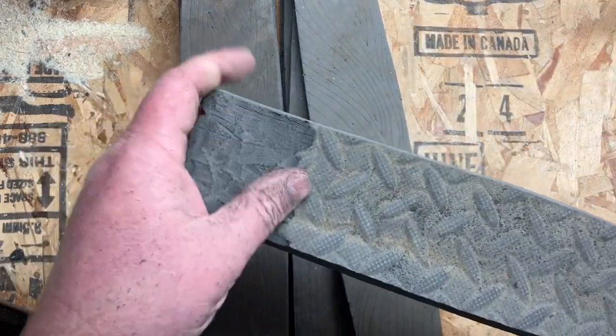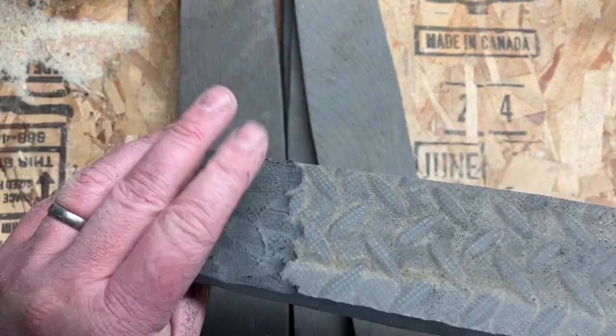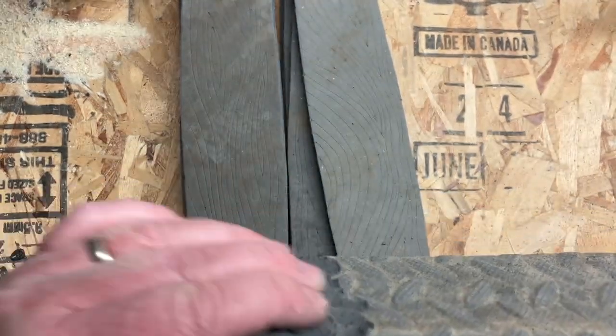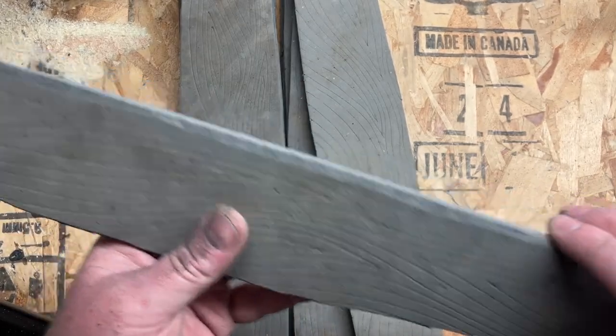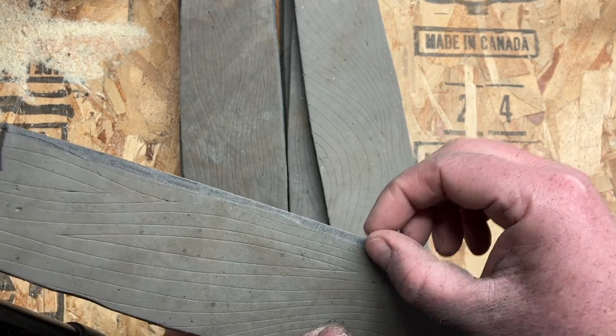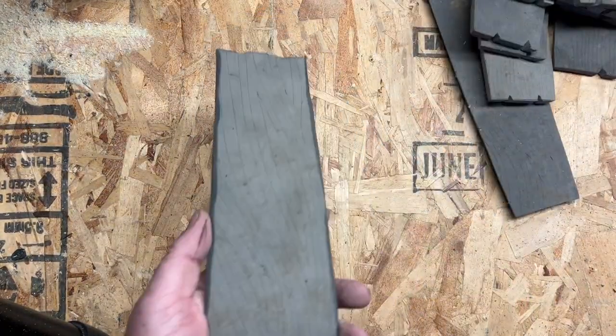You can see there how I managed to get all of the finished side roughed up. We're going to be gluing something here, so you have to make sure you don't go down too far — just want to make sure it's rough enough for something to stick. Around the outside I just chamfered the edge. You don't want to be too hard on this, just a little bit so it ends up with a really nice difference between the staves.